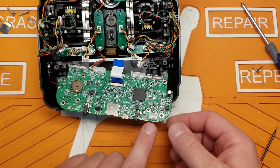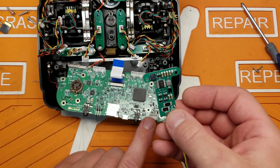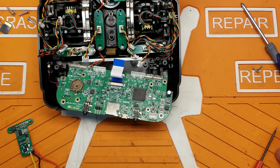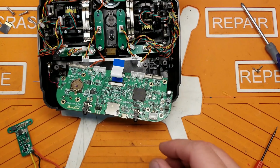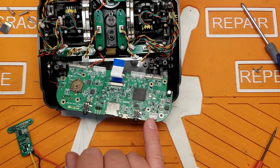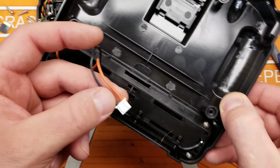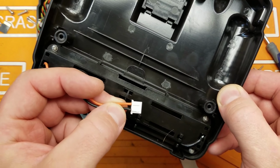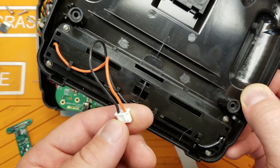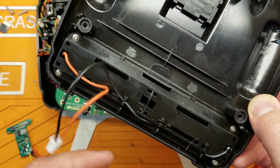So what we're going to want to do is wire our board's 1S, 2S, and ground to this plug respectively. As if you had a 2S balance connector, which I had, I don't know what I did with it. This would correspond to ground, 1S, and then 2S. And if you've noticed on our back tray, we don't have that center conductor as if this were a 2S balanceable pack. And we're going to need to add that in there.